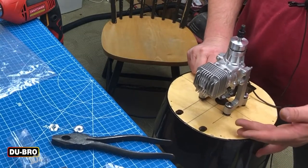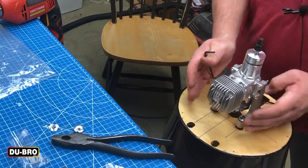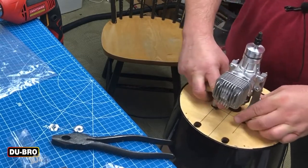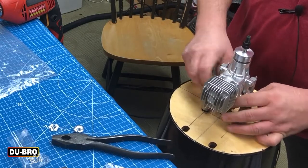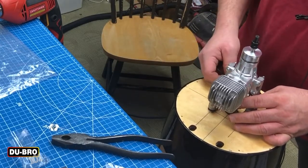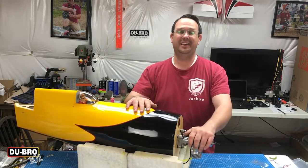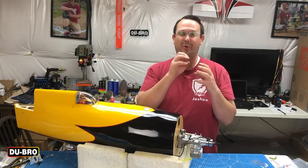So that's two corners in place. Because I have those two corners in place, I'm not going to be rotating the engine much, so I can use the elastomers to sort of wiggle the bolts around and get the last two blind nuts in place from the back side. Now the engine is mounted — it's ready for plumbing, and it's ready for me to work on the cowl and have the dummy motor centered on the prop hub as well.